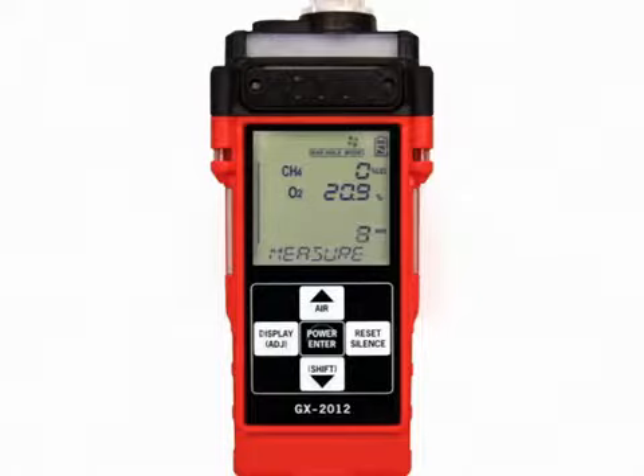At the end of the sample period, the pump will shut off and the buzzer will sound. Then the peak methane reading and the minimum oxygen reading for the sample period will be displayed. The peak methane reading will also be visually displayed on the graph along the left side of the screen. If a high concentration of methane is encountered, a fresh air purge can be performed to purge the hose, probe, and the GX 2012 of gas before the next barhole test.